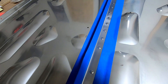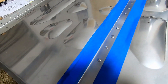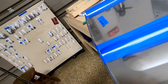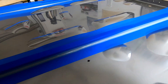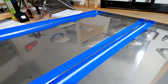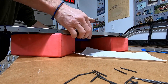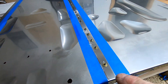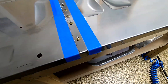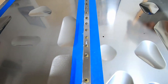It came out really nice. I'm going to keep this side clean — let me spin it around so you can see. I ran a little bead around with my finger over it, so that'll seal it. Once we do it to the rest of the skin, we'll fillet that in. On the other side, I can see some penetration where it's oozing out, so I'm happy with that — it means you got good coverage.